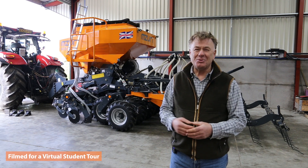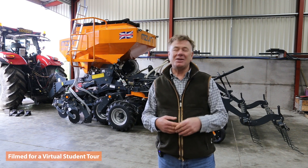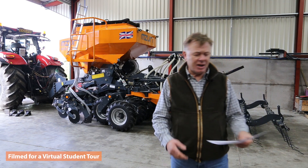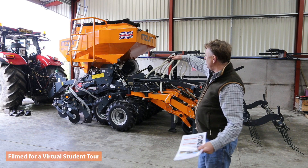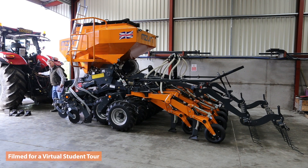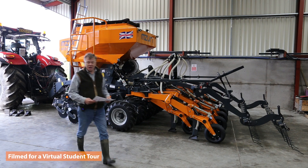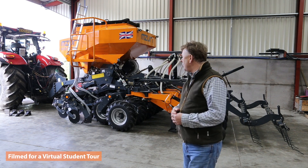On days like this, normally with a group of students, there's always a handful who stay behind — particularly engineering students — who want to pick my brains. If I was going to give you some tips: think about field setup guides with lots of pictures — a great thing to have in the cab. This machine must run level to do its job, and we have a measurement reference point at the front. Hitches and tractors all change in height, so we have the Schümler hitch system — you unbolt and fit one to suit whichever tractor you have. In Eastern Europe, they tend to hitch much higher, so it's easy to turn it all around. Things like that are a great help.